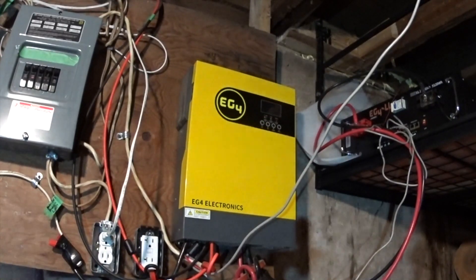You'll notice the light flickering in the background because I've got an LED here. LEDs flicker a bit more when larger loads come on — that's common in areas where the grid wasn't perfect in the first place. It doesn't seem to cause a problem. I do have a UPS on my computers and sensitive electronics just to keep them safe. You will see some of that with heavier loads coming online because this is a high-frequency inverter, not a low-frequency one, which really handles those large inductive loads like the microwave or well pump coming online. So there is a bit of a sag there.